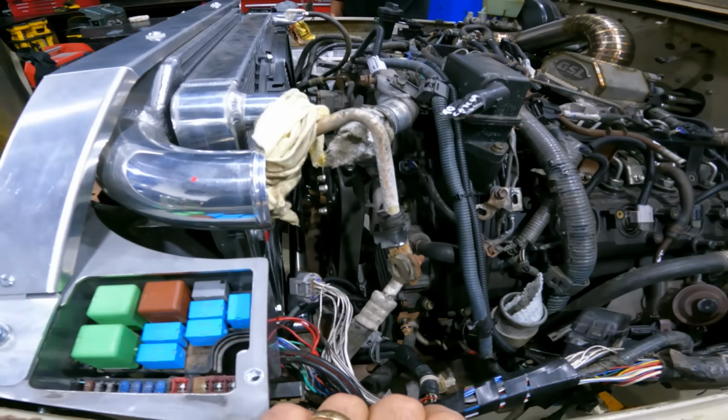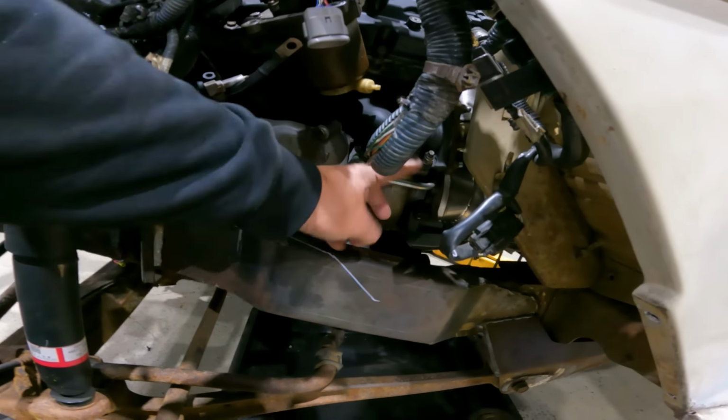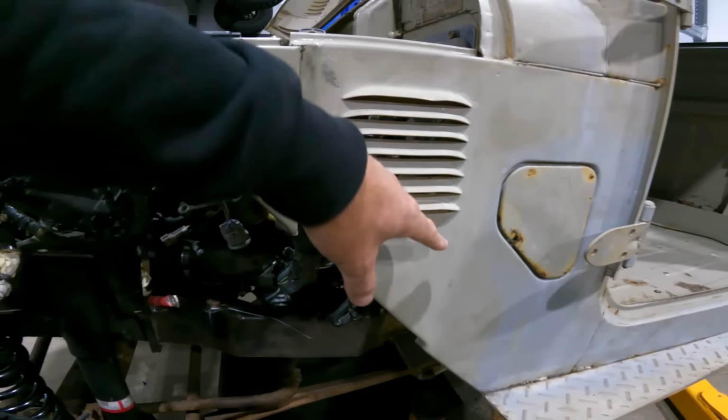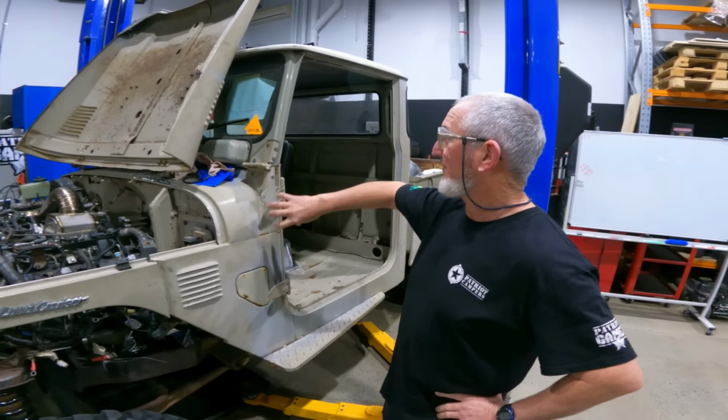But obviously for this truck, we've got no room to put an airbox in. They're going to lobster back all of this pipe work around here. We're going to put a heat shield on the turbo. Come up, poke it through here somewhere-ish, and get it all on, yeah? And then snorkel a bit up here.